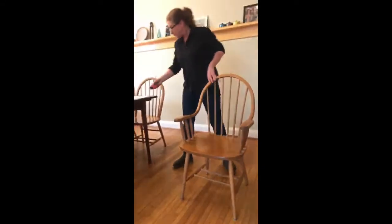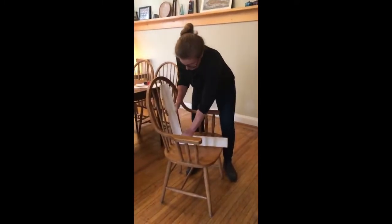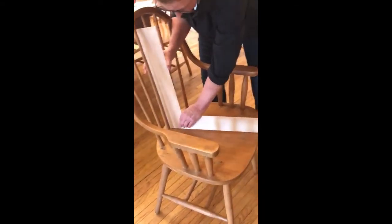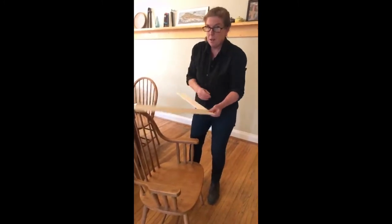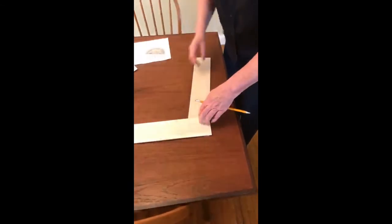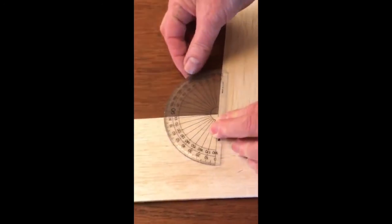The angles and curves are probably the most difficult aspect to measure. To measure the angle between the seat and the back, you can use cardboard, foam core, or whatever you have around. Place one piece against the backrest and one piece on the seat, then mark with a pencil so if they fall apart you can put them back together. Place a protractor on top — and this is telling me it's 97 degrees.